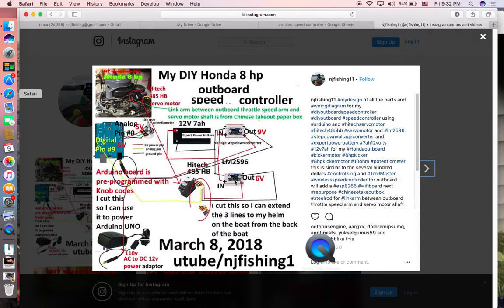The black wire connects to a second step-down voltage regulator - part number LM2596. I bought two of them. It takes in 12 volts, and this one has a dial so you can adjust it - I stepped it down to 6 volts. You can check my other video for how to do that. You can turn the dial to reduce the voltage to anywhere from 3 volts to 10 volts from a 12-volt input - it's all easily adjustable.